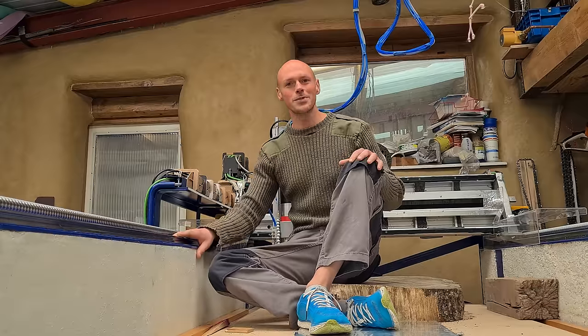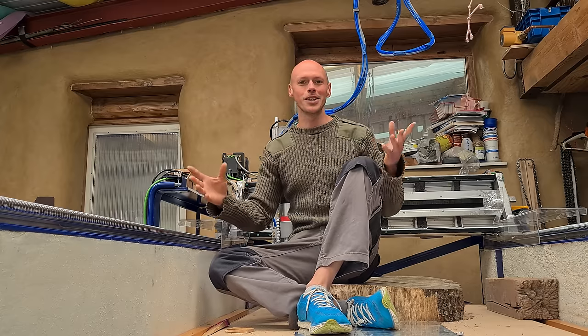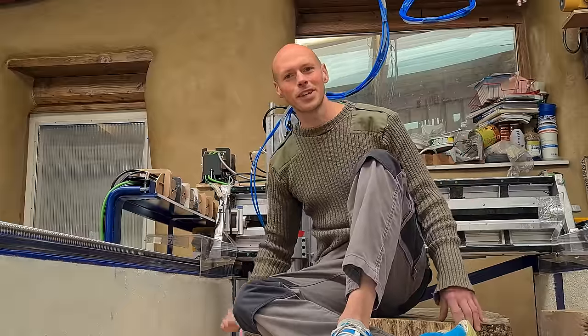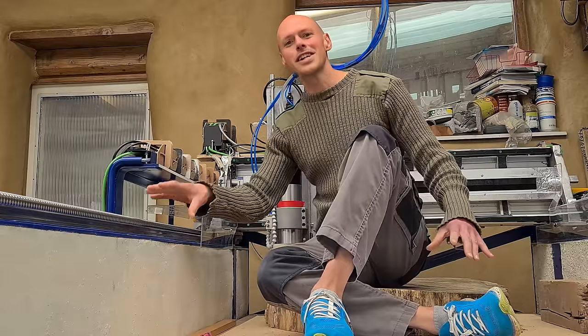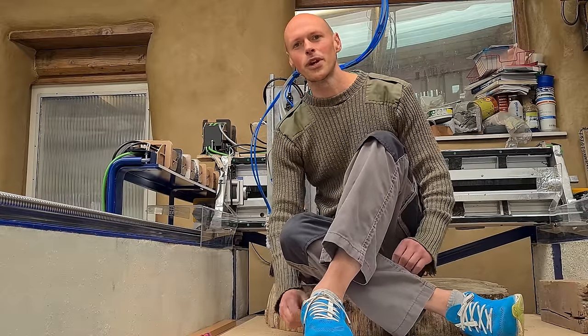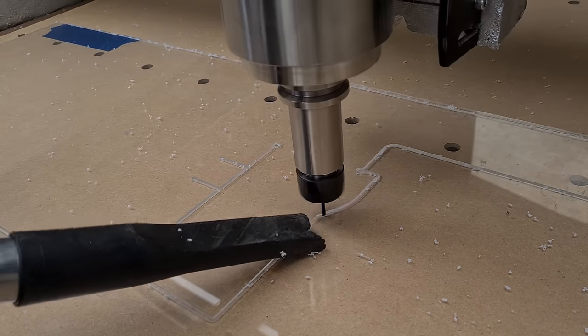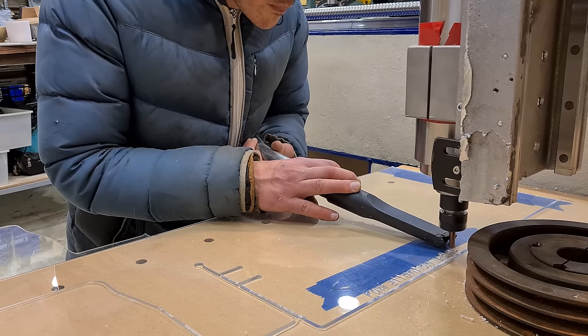We've had quite a few adventures with this machine now, but I still feel like we're only just scratching the surface of what it's capable of. Most of that proper full-on testing is going to have to wait for the next video — this is already quite long. The frame itself feels like a really solid and dead foundation, and I really like that the rail and ball screw are raised up and that's where the z-axis gets its height from, rather than two flibbly gantry plates at either side. Having it raised up also means the ball screw and rail are a bit further away from the bed where all the chips and debris are flying around. Even so, some chips — especially when milling aluminium — make it up there, and our ball screw has very poor protection against that kind of contamination.